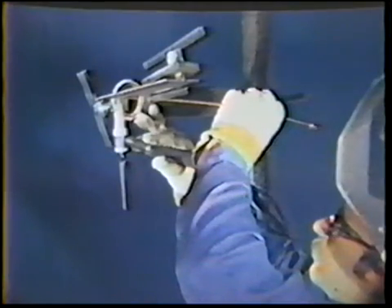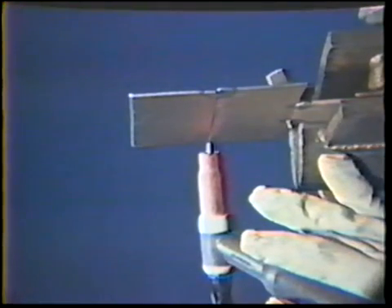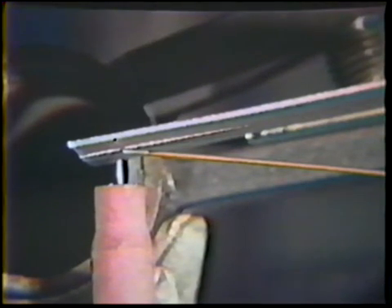This is a difficult position for welding because the molten metal tends to fall, and it is uncomfortable to work overhead — it takes much care and practice to master it. The work angle will be 90 degrees. The travel angle will be 5 degrees push. The filler rod will be fed in at a 20 to 25 degree angle directly under the axis of the joint.